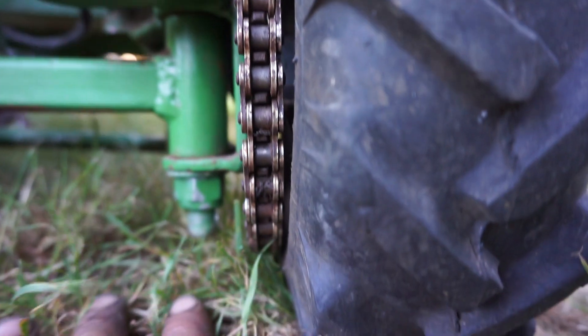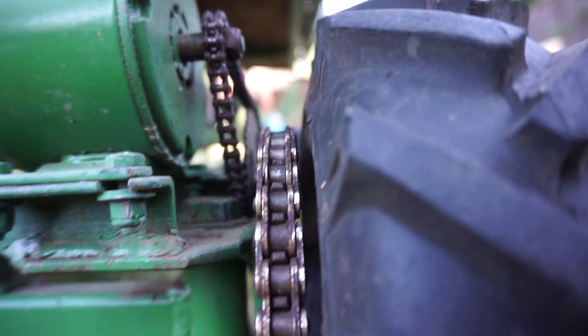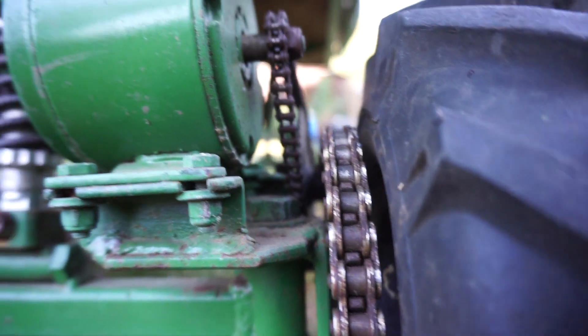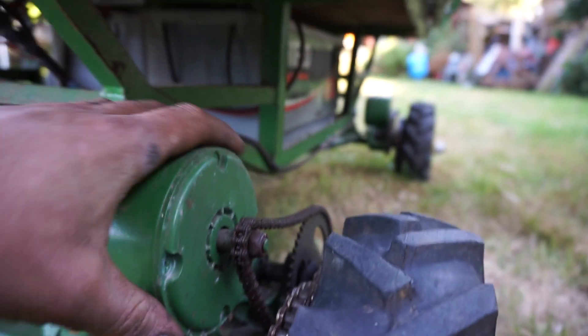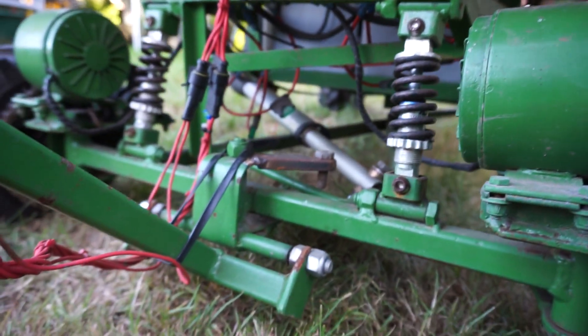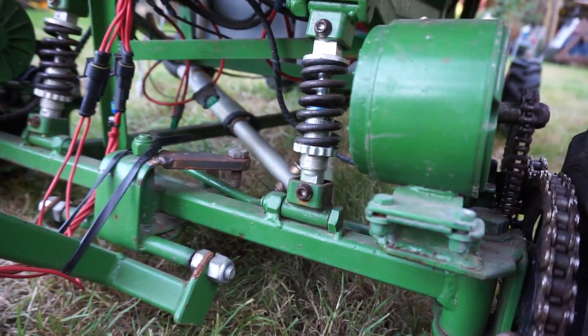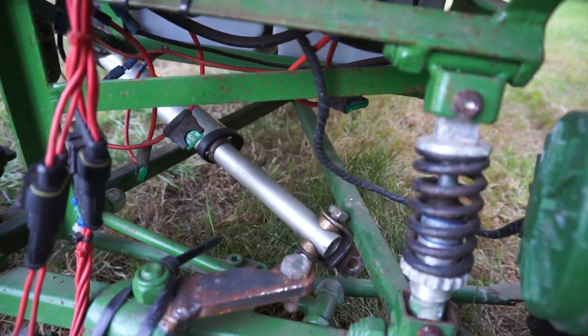It's fairly close — when the tyre squishes down a little bit it does just-and-just touch, so I think I'm just-and-just getting away with it. The motor is adjustable there, and so is the jackshaft back there, so it's all moveable as it wears. Steering-wise, they've just got a link on behind there — two rods tied into this middle one, pivoting on that bolt.